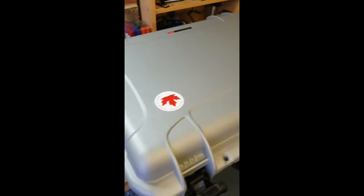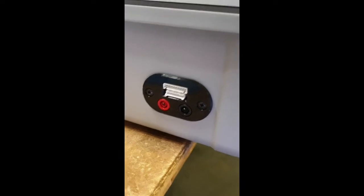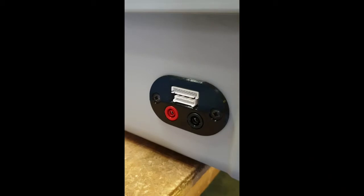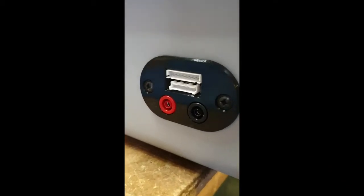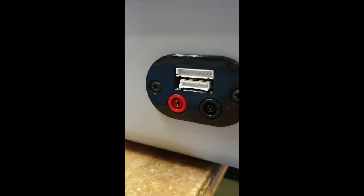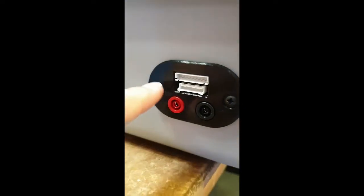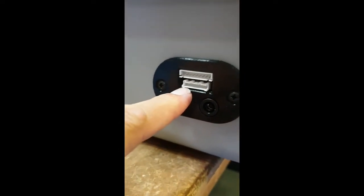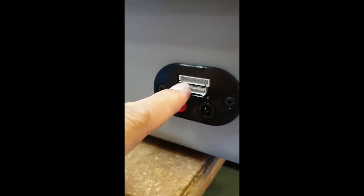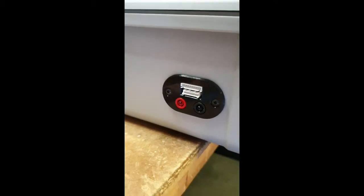Not too much to see on the outside, apart from, like some of my other builds, we've got the charger outputs on the side. So this one obviously follows on from the one I made on the last case for George Jones, but instead of having a Super X, we've got the same 4mm banana connection points as found on the front of the Revolectrix chargers. And then of course we've got my little balance board built in. So you've got the original JST PA connection for the MPA board, and then you've got the matching 9-pin JST XH connector up top. So that allows flexibility when it comes to balance boards.